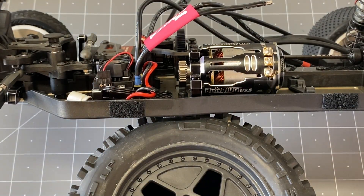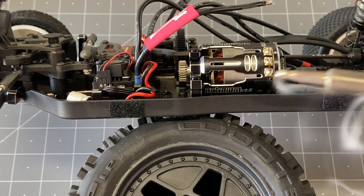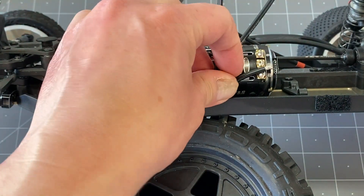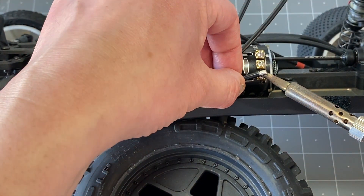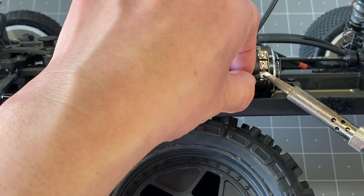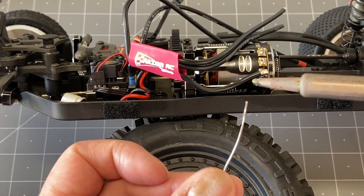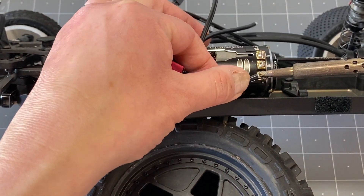The way I do this is I like to take the soldering iron and put a little bit on each side, then solder the two together by heating up both sides at exactly the same time. I stick the soldering iron in between the wire and the tab of the motor and heat them up simultaneously until they both liquefy. Then you can put them together and push down on top with the soldering iron to make sure it's placed where you want it.